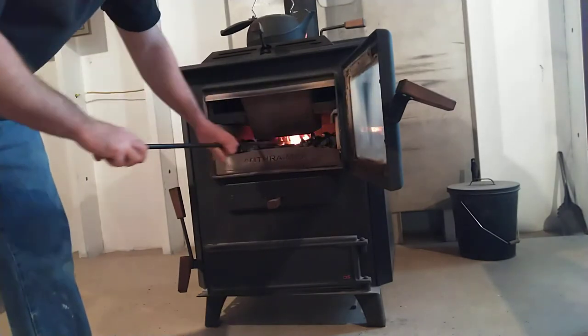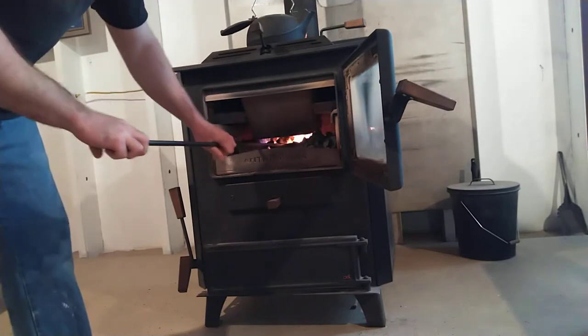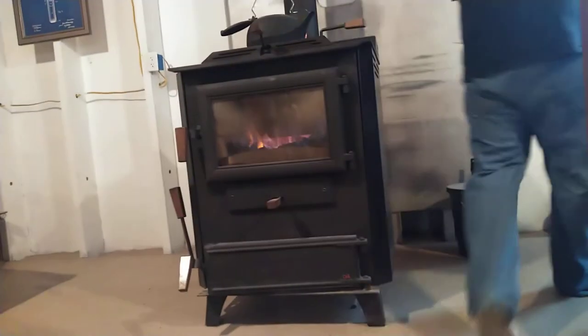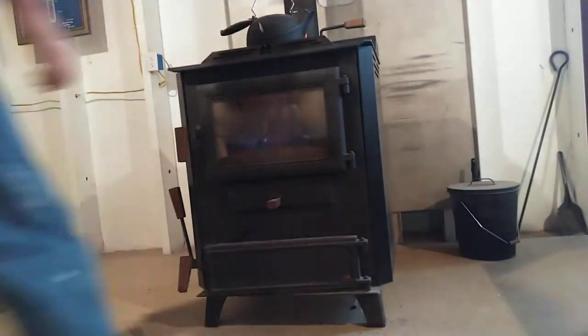The hopper is empty. I can see it's all spread out — some of these coals are spread to the sides, so the sides are built up really deep. Close the door. And just by doing that you'll see a lot more flames coming up because you've opened up some more air to flow up through it.